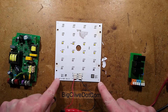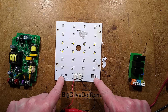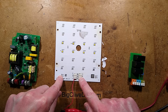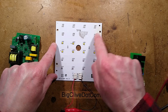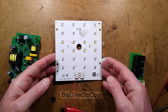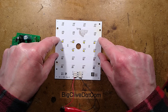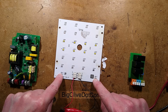The circuit board has little configuration links down here. I've had to put a blob of solder over them because it had zero links. By default the negative goes to the bottom and the positive to the top, and it basically snakes down. By using these links you can divide it into different sections, so if you need fewer LEDs you can highlight just a section in the middle, which is what they've done by fitting the two bottom links.